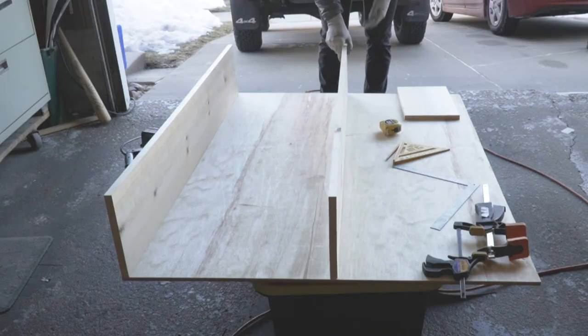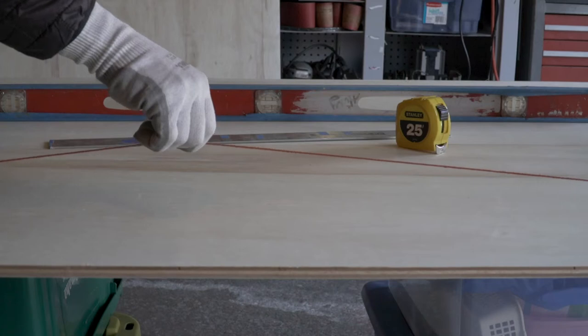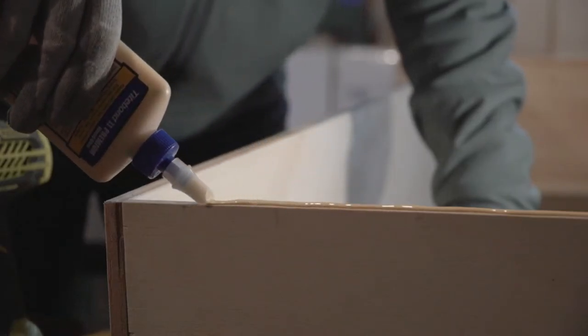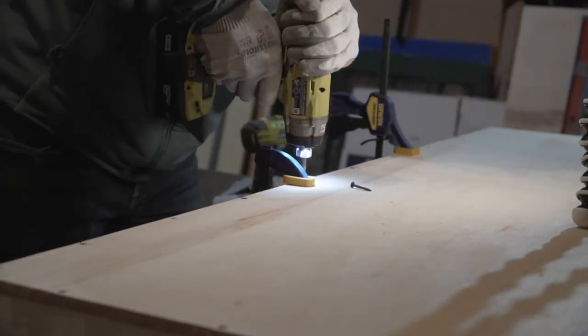The first cut I made was for that big baseboard that was going to span the entire bed of the truck. After cutting that down, I cut the pine boards that would be our walls down to length as well, and then I cut a piece of half-inch plywood that would be the top of the housing. Throughout the build I followed the same process of drilling out a pilot hole with a bit, counter-sinking that hole, then removing the wood pieces, applying glue in between, bringing them back together, and applying my final screw. After cutting all of our pieces from the plywood, we assembled the four walls of the box together and then screwed the bottom floor of the drawer onto the assembled wall structure.